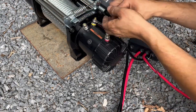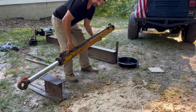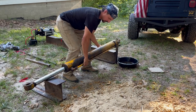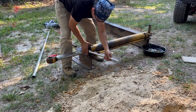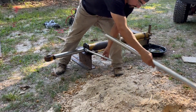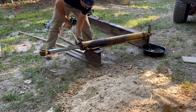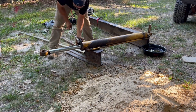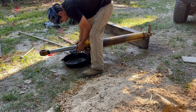Here, I'm wiring up my winch and getting it ready to connect to the battery. This is where things get interesting — I took a piece of that same size I-beam and put it under the gland nut at 90 degrees to the original I-beam. I did this because when you're taking off the gland nut, you can actually torque against that I-beam and use it as leverage. When putting your cylinder back together, all you have to do is move this small piece of I-beam to the other side and you're still torquing against that larger I-beam section.